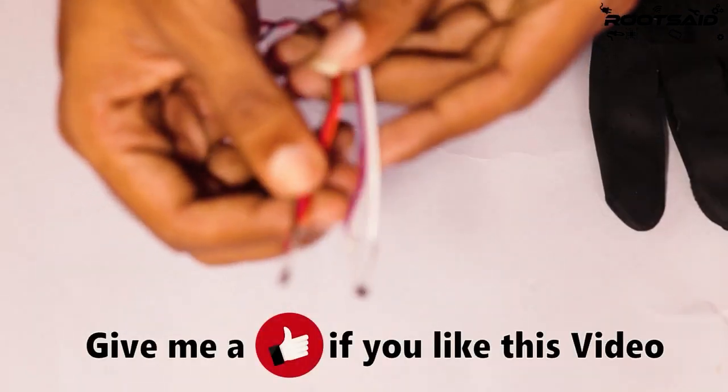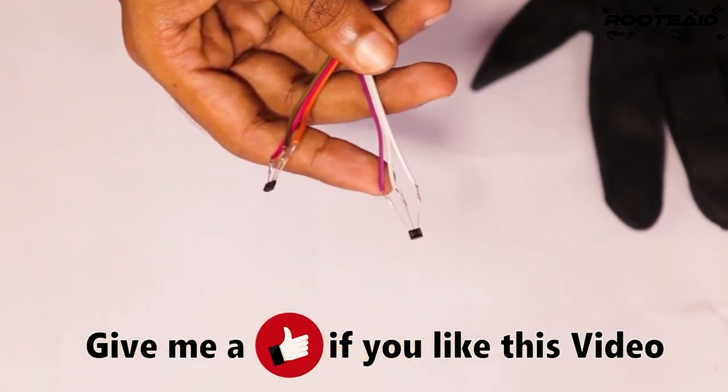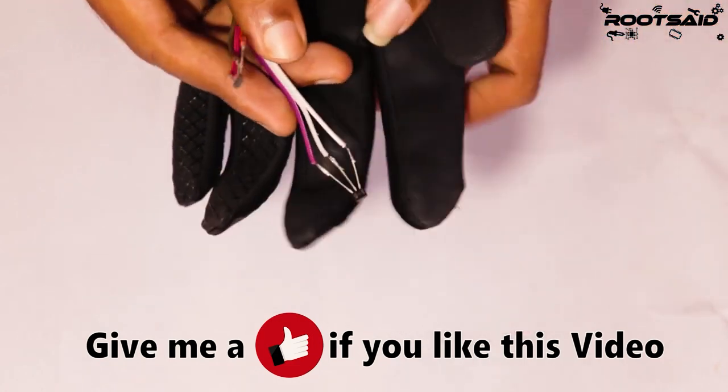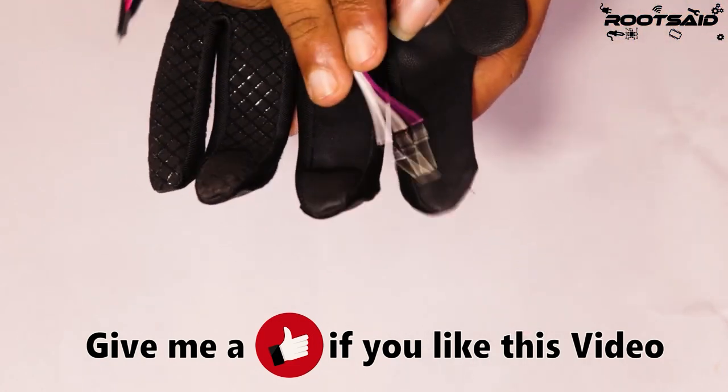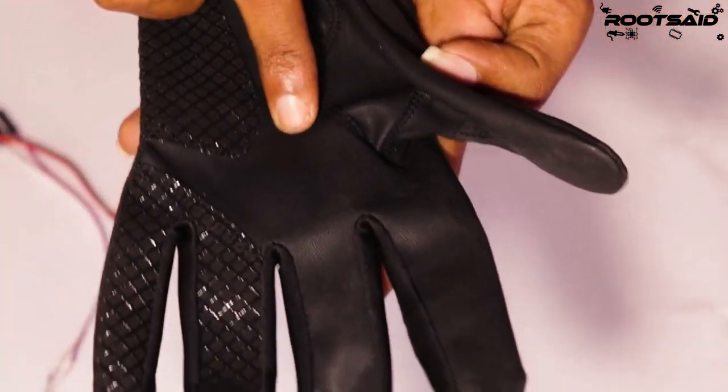Here you can see I have already soldered two of them with these jumper wires so that I can easily connect with the header pin on the circuit board. These Hall effect sensors will be fixed somewhere near the fingertip of the glove. And finally, I will be gluing a strong tiny magnet somewhere here. Now, this is how it works.